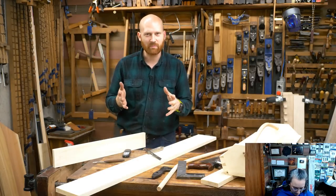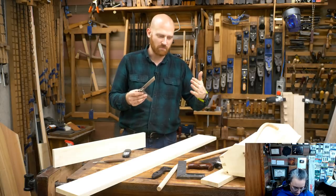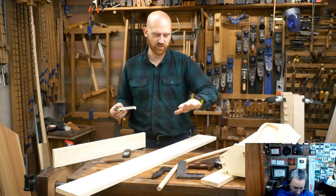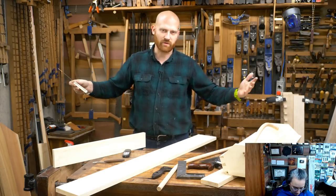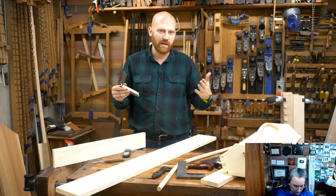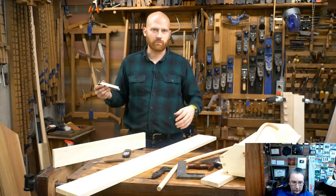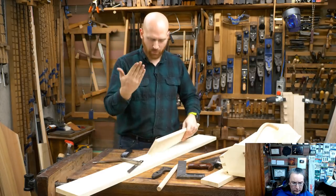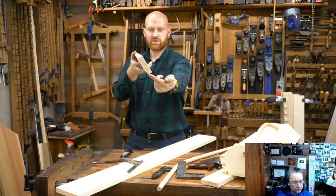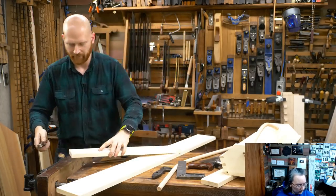I don't know why that tends to scare some people when you drift away from the plans a little bit. The way I like to build things is I like to make them and then adjust to reality. Whatever we do to this, we just adjust it on the next piece. That's why I don't do a massive cut list where everything is cut to shape ahead of time. I build one piece, then make the next piece match that one. If you do have any drift over time, you can fix it. If you cut everything ahead of time and there's a little bit of drift, you're already cut and you're up a creek without a paddle. What we need to do is put an angle along the bottom edge — we need to cut off this bottom corner and slice it off.